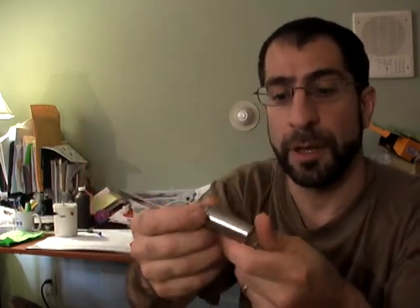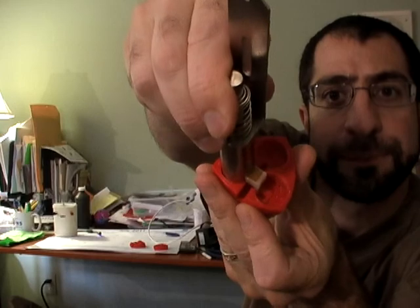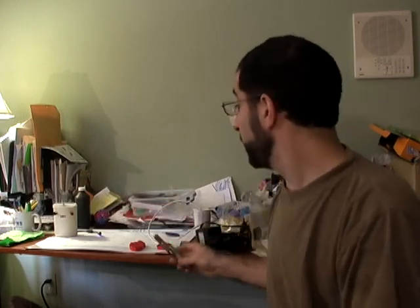We'll grind off this piece. On the bottom, the solenoid almost fits — it's the right diameter, but that little connector on the bottom is a different shape and doesn't quite fit. So we're going to cut away a little bit using a Dremel, and it should work just fine. I did test the electronics out, and I built the circuit just as described on Makezine.com — these work fine. You have to cut down the included spring to about six turns, leaving a little less than half. I'm running mine at about nine or ten volts, not even twelve, and it works great — at least as far as electronics is concerned. I haven't built it yet, so with proper use of some power tools, let's see if we can build an Econospazi.